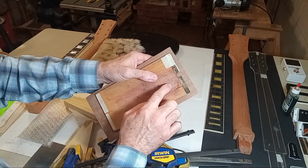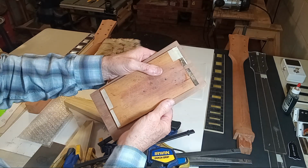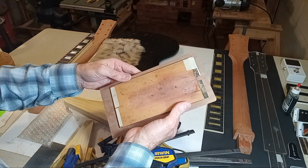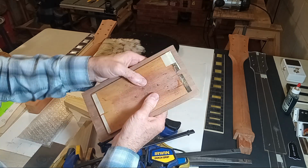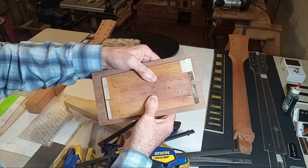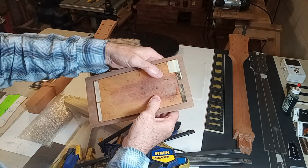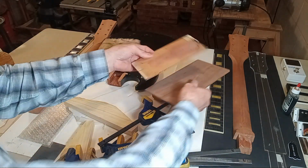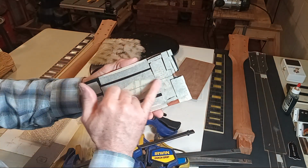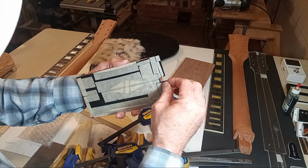Better to have a little bit too much epoxy. It's like a reversed injection molding. It's like an exit molding. We'll call it exit molding. So it's better to have a little bit too much epoxy, just a small amount too much, so that when you do squeeze it out, you're guaranteed that from a tonal standpoint and a strength standpoint, it's 100% epoxy under your tape.